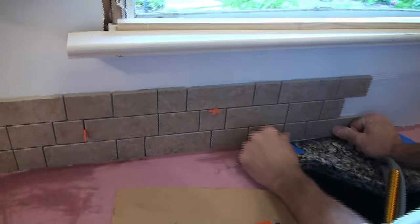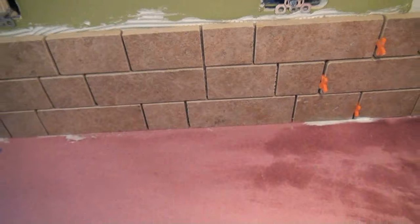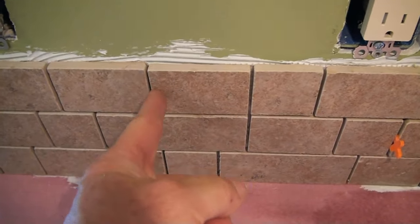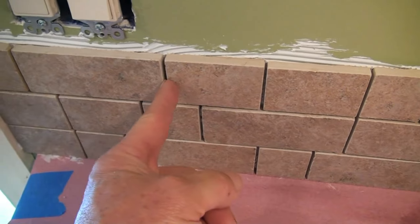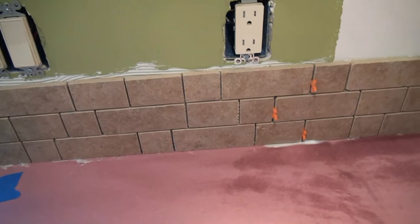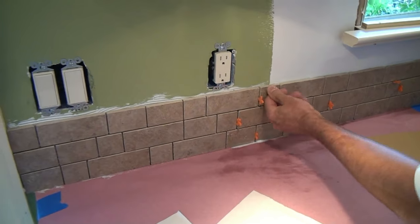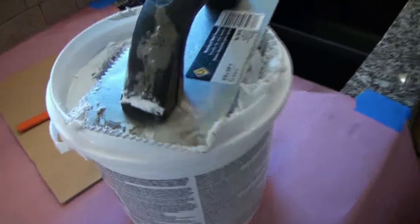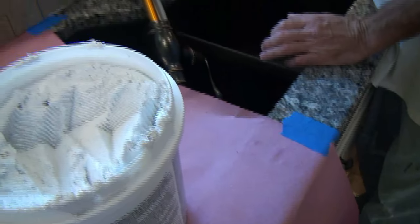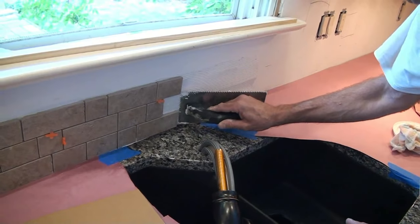Check your spacers — moving right along. Another reason you don't want to put the mastic on too thick: when you push the tiles in, if it's too thick it will squish out between the cracks, and you'll have a hard time getting that out of there. The only thing we want in these cracks is the grout we'll be putting in tomorrow. You do not want the thinset or mastic to squish through the grout joints, which is why we're using a 3/16-inch notch trowel and not a big quarter-inch notch trowel.